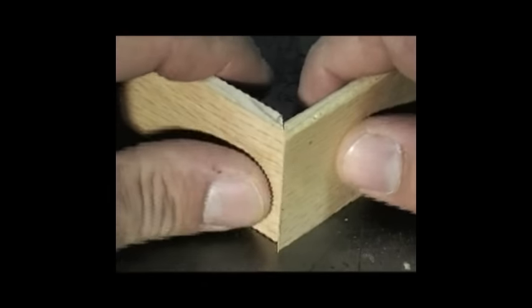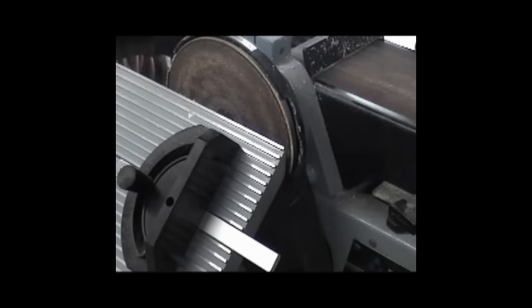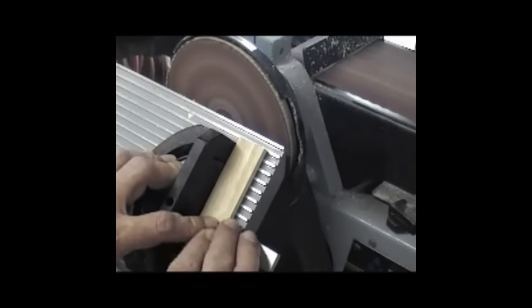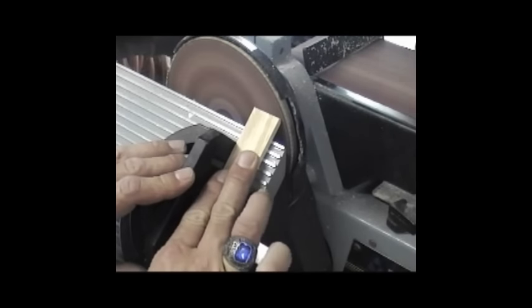Need a 45-degree bevel on your fretwork edge? I bought this disc and belt sander for less than $100 at the home center. It's perfect for sanding bevels of any degree, including the more difficult 22.5-degree bevels required on the dome clock. If you just can't get one, though, you could use a table saw to cut your bevels. Just do it prior to making the inside cuts.